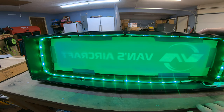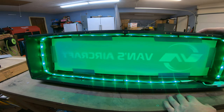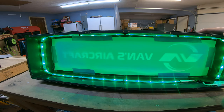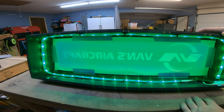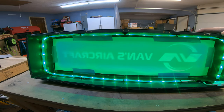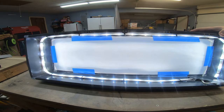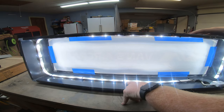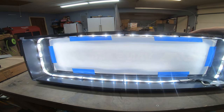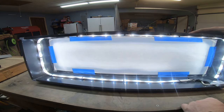The other thing I ran into was this LED strip light. For whatever reason, I don't know if the process on the back of the light strip was not properly treated — it's got an adhesive strip you're just supposed to remove and stick to the surface, but that strip did not stick. It's just super slick on the back side. I even tried originally a JB Weld type two-part epoxy, did a quick curing, mounted it, let it cure overnight with some weight on it, and it still ended up just peeling right off. So what I decided was I just have some of these little adhesive strips that are made for running cable ties through — just cable organizers I bought on Amazon a long time ago. I adhered a bunch of those every so often and ran a zip tie through. That holds the light strip perfectly fine.